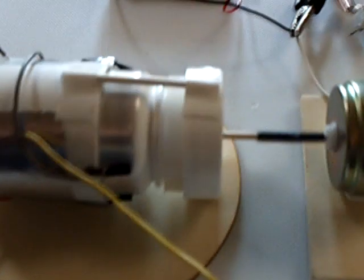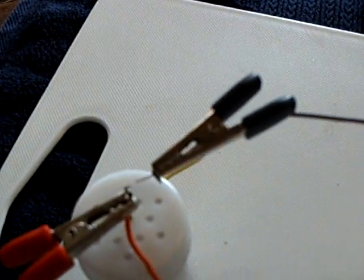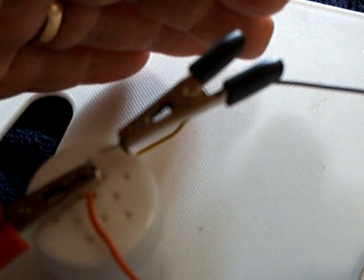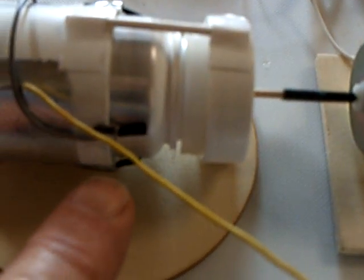And what I'm having a problem with right now is it arcs within itself here, and you have to have these spacings and gaps such that you don't have internal arcing. The reason the spark gap is so small on this is the spark is actually jumping across here much of the time. You can see as this thing opens up and snaps shut — there's a spark going on in here, and part of the time it goes off here, and part of the time it doesn't.